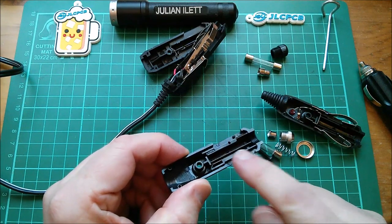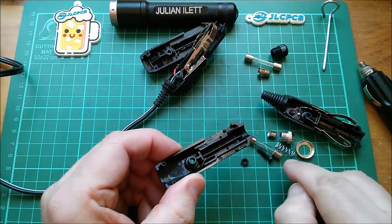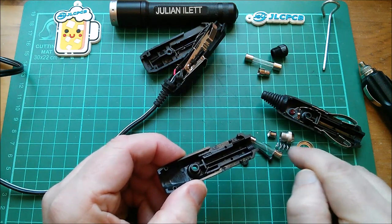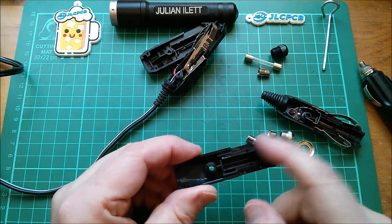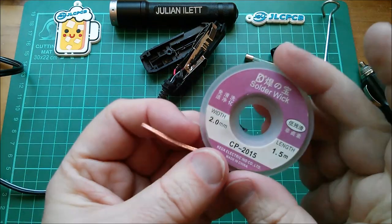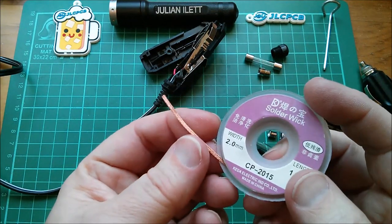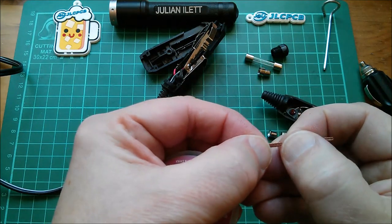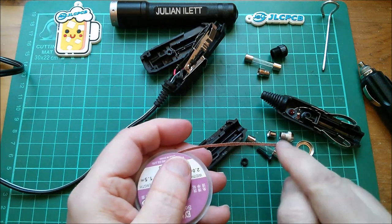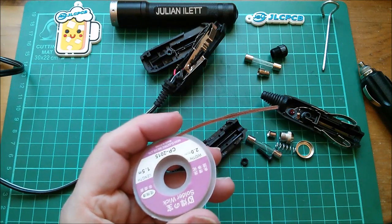I think the same is going to happen to this if I put 10 amps through it for half an hour, as happened to that. So I want to implement a mod. Since I believe it's the spring that's heating up and causing the problem, I want to provide a short circuit across the spring and yet still have its springy function. My idea: copper braid in the form of this solder wick. It should be collapsible — yes, it can take movement. If I wrap that somehow around the spring, we'll get the conductivity of the copper and the springiness of the spring. That should work.